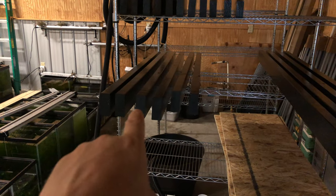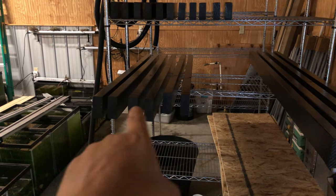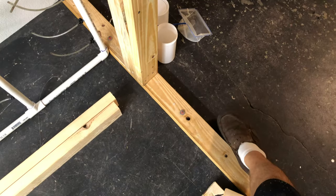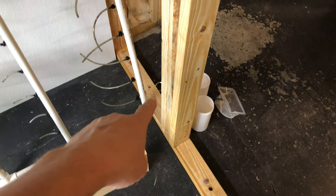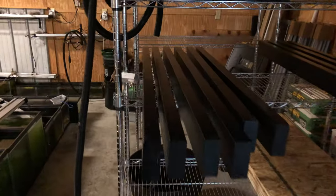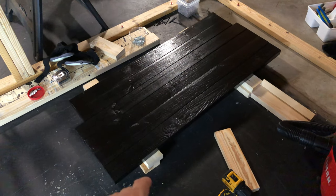We've got four pieces at 48 inches and two at 44 and 5/8. The reason they aren't all the same is because the one on the bottom is going to go into this wall to this edge, so I cut that a little shorter. You'll see what we do to compensate for that, but the rest of it is actually going to go in — it's just that footing we've got to work around. Even though we're building this in a different sequence, we can prep it like we've been doing in the other videos.